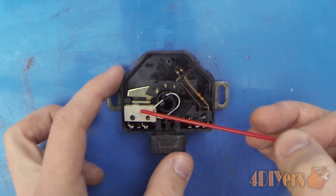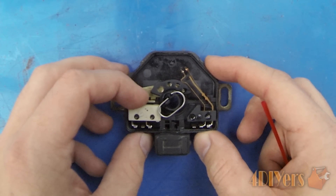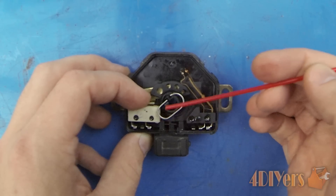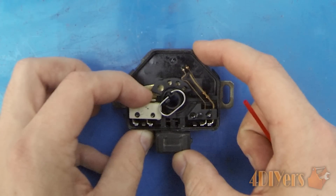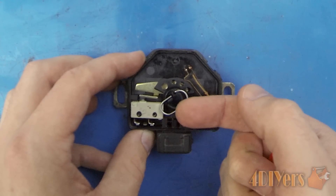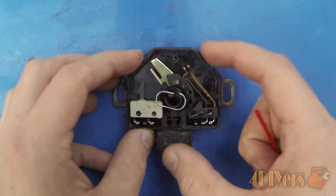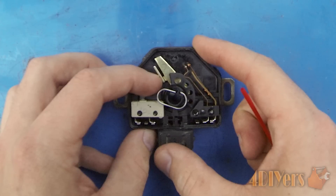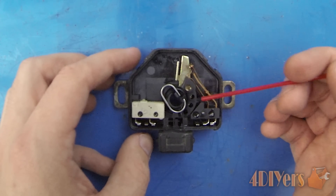The micro switch was faulty on this one. With the throttle plate fully closed in the idle position you can hear the click — that switch is depressed down all the time and only releases when you adjust the sensor back and forth on the side of the throttle body. When you increase the throttle a little bit it kicks off the idle cycle. The shaft that holds the butterfly extends past the outside of the throttle plate and has a lobe that activates the wide open throttle contact, holding it there so the computer adjusts accordingly.